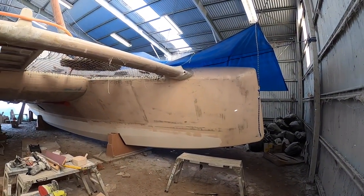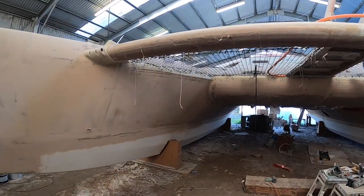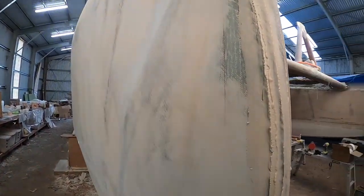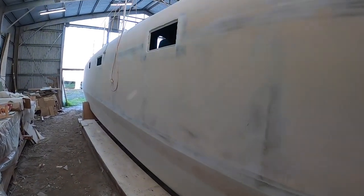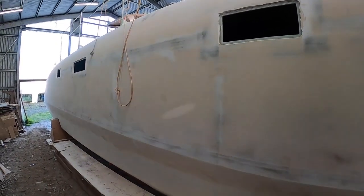I've applied fairing compound on the inside of the two hulls here and the forward section of the bridge deck. Because I've done that, there's a bit of an overlap with wet fairing compound on the bows — this bow in particular. For a second I figured I was a bit held up with paint, but no — I'll just not paint all the way out here, which is absolutely fine, because I have to sand the inside of the hull and get paint on that. So instead of moving on to putting more fairing compound in another position, I've decided I'll put some paint on the starboard side.